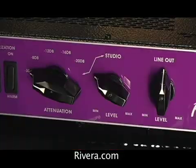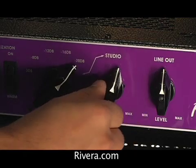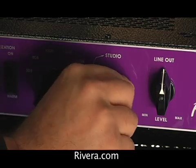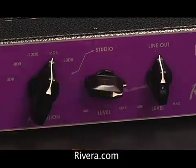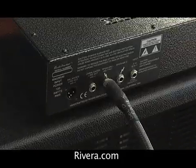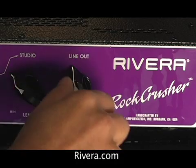On our unit, we have the major power attenuator switch. We have a position on the switch for studio, which we call our studio control — a volume control that takes it from reasonably quiet to very quiet. This is the kind of thing you would use in your bedroom or studio recording. We also have two line outputs: a balanced line output and an unbalanced line output. The balanced line output is transformer coupled. There's a level control for both, so you're able to take a feed directly into your Pro Tools, your mixer board, or whatever you want to do. Maybe in your live setup, you send it off to the PA and the PA guy can mix it in along with the microphone.